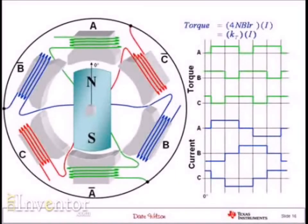Now I've basically connected all the phases together and current can actually be shared between different phases. For example, I'm going to take phase A and pull it high with a transistor so that it's pulled up to the positive DC bus voltage, and I've got another transistor tied to phase B pulled down to ground. Following the current path: current flows through phase A, goes through that coil, jumps down to the phase A bar pole piece, hits the neutral node, goes over to phase B bar, goes around that stator pole piece, and finally out through phase B to ground. With this kind of arrangement, positive current in one phase can actually become the negative current in another phase.